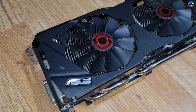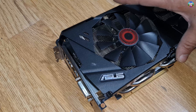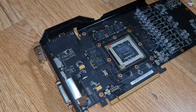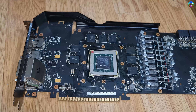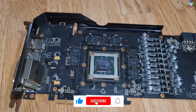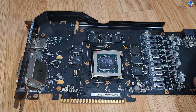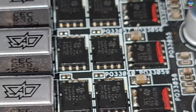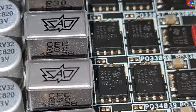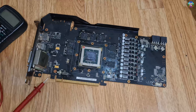Hello and welcome back to the channel. Today I'm going to show you this Asus Strix GTX 980 — not the 980 Ti, it's a 980. I have already removed the fan and heat sink, and I tested it already, but I wanted to show you what I found in this card. The customer tried by himself — he put the heat sink back etc. — and I just diagnosed it. You can see these MOSFETs: these ones are M3054M and the others are M3056M. These are the MOSFETs connected to the core and also the VRAM.